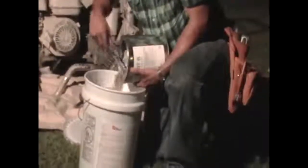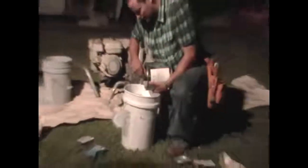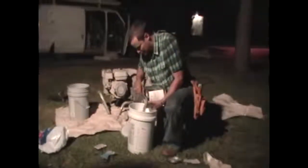Combined together, this will make 5 gallons of paint, which usually does anywhere between 1,325 square feet upwards of 2,000, depending on the size of your paint spray nozzle and the thickness that you applied onto the decking.